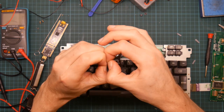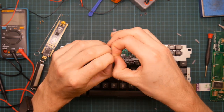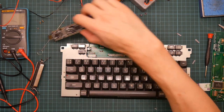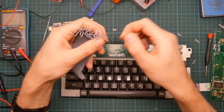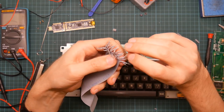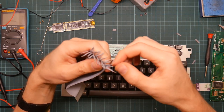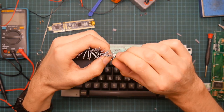I could just solder all the wires to GPIO pins and then figure out which one to set to 0 and which one to set to 5 volts in software, because this particular microcontroller will let you do that. But I'm not entirely certain whether the microcontroller's GPIO pins can provide enough power to run the LCD. Okay. Twist. Gonna have to do it all again on the other end, but worse.